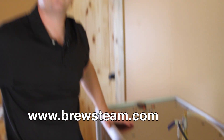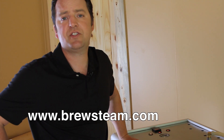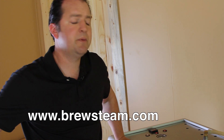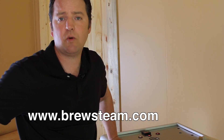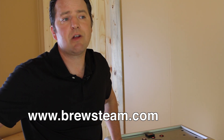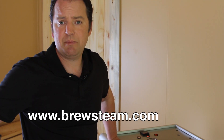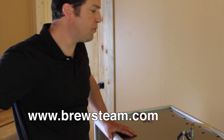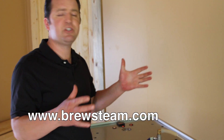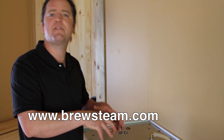The heating element system is a full 10,000 watts — we can go from 8 to 10,000 watts. At 10,000 watts, it's easily a full barrel system. It can bring a boil from city water temperatures up to a full rolling boil in about 63 minutes. It's very quick, very efficient. A lot of systems, whether you use gas or steam jacketing, you're losing a lot of heat to the air. Our system, we're heating from the inside out.